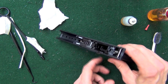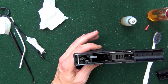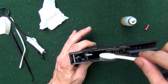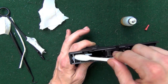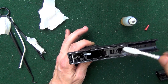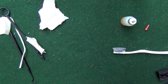Up next we're going to work on the frame. The parts that we're going to spray a little bit of CLP on is going to be right in here — up near where the trigger is, just above that, as well as back here in the trigger housing. Spray there, spray there, and we're going to do the same thing — just work it around in there, get that lubricant in there. The benefit of using CLP on these polymer frame striker-fired guns is that it does kind of everything. We're going to go ahead and wipe this up and it leaves behind a nice thin residue of lubricant and protectant.